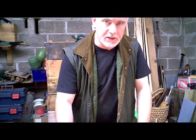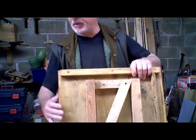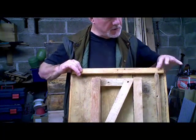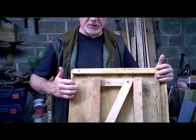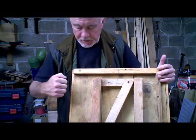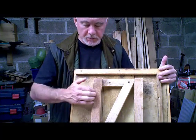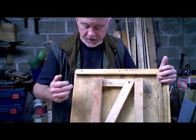So to avoid that, start off with a really solid working base. This jig here has a base that is about an inch thick and it is framed both top and bottom with some solid timber. It is made from seasoned wood — this is also very important. Make sure you make your jigs from wood that is not going to move around. This wood has actually been in somebody else's workshop for about 30 years, so it is well seasoned.